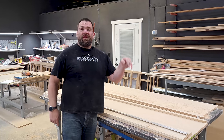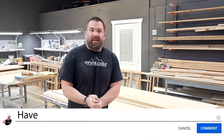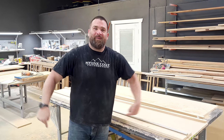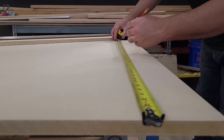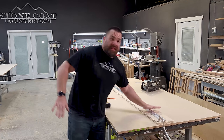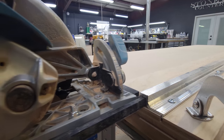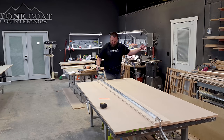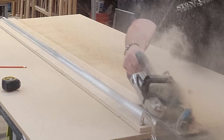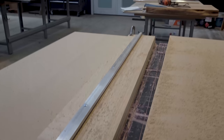I want your feedback — let me know in the comments below. Have you used another brand saw guide and how did you like it? Were you pleased with it? How much did it cost? Do you still use it? So just grab your tape measure, mark where you want to cut, move the saw guide over to your mark, clamp the saw guide to the two points, and we're ready to cut. Engage the front of the saw guide plate into the track, fire it up, and we're ready to go. You can see that has cut perfectly right along the saw guide.